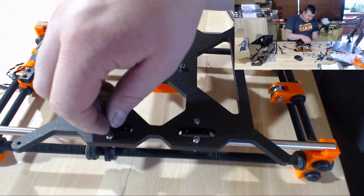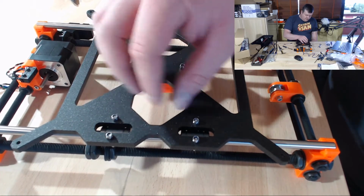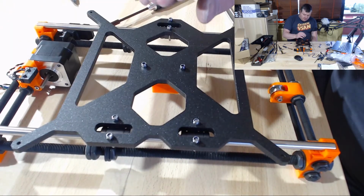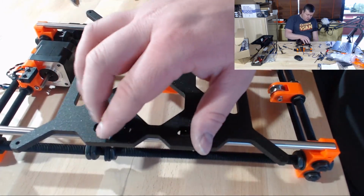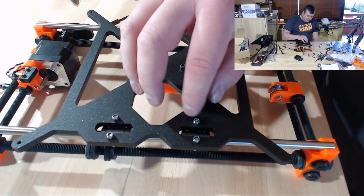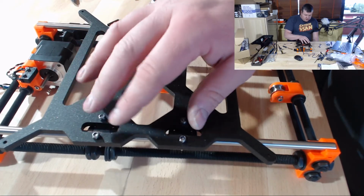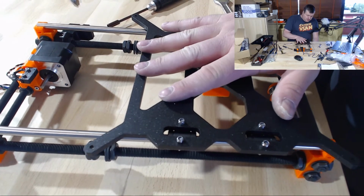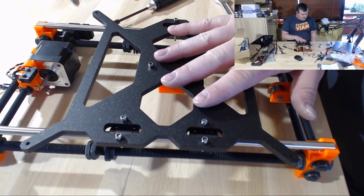And the manual states that even with the original bearings, do not overtighten them, just have them lightly touch the plate, because they will collapse the bearings. So it's not just an issue with the IGUS bearings, just in general, make sure you don't overtighten. I found the aluminium cased bearings are much stronger than the plastic ones, so just make sure you don't use the plastic ones in here. I think this is a quite good step to be done. So I think I'll just carry on with the next step.